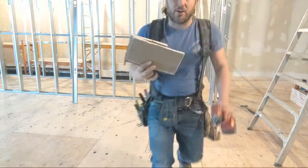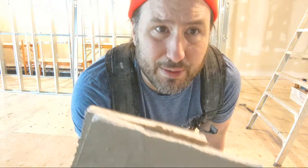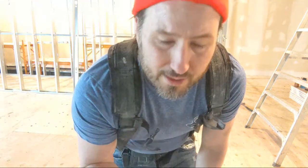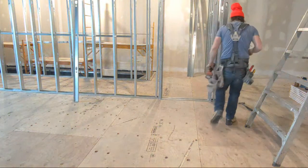Okay, and I also have my drywall spacers. You'll see that I'm gonna put the drywall in on either side so that I have proper spacing for the drywall to slip in behind the door frame. The wall is level, okay? I've lasered in the top track from the bottom, so it's level. The doors, studs are all plumb, okay? Because they're lasered in and measured in, marked, they're perfect. So all I need to do is make sure the drywall fits and the level will be perfect. Okay?